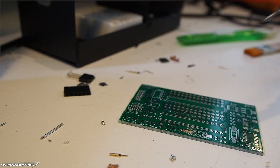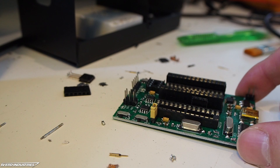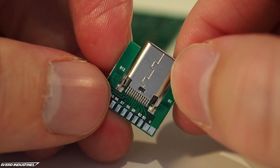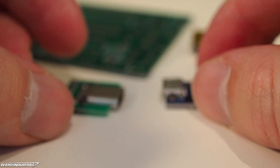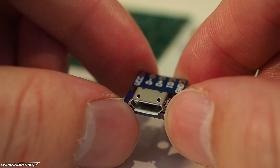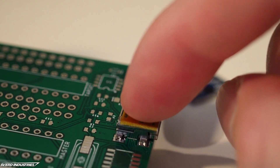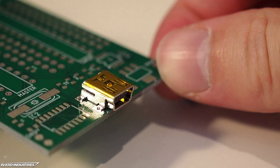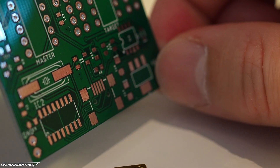You may be wondering why I'm using a mini-USB connector when there are smaller connectors available. The other real options were USB-C or micro-USB. USB-C would be cool to add, but the connector is a bit too fine-pitched for comfort. While micro-USB is okay to solder, it is not mechanically very strong and can't handle the same regular use as mini-USB, which has four mounting pads as well as a couple of stress-relieving pins that help when inserting and removing the cable. So in short, I went with mini-USB because it's easy to add to the circuit and reliable in use.